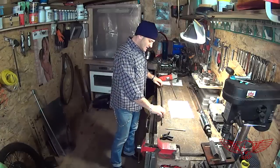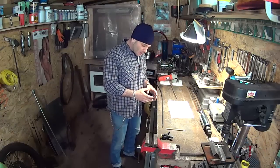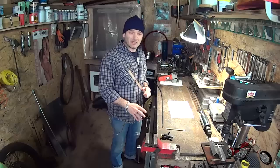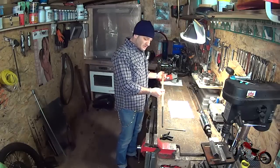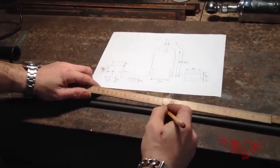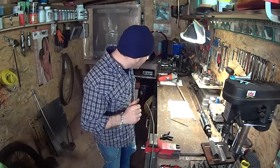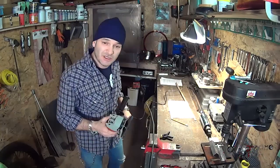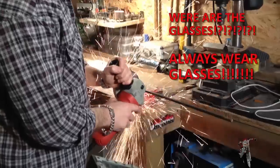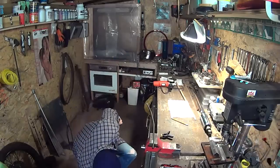To start, we're going to cut to size the pieces of metal that we'll use for the structure that holds the bolt, which will allow the threaded rod to go and compress the shock absorber. You can download the plans for this in the link in the description below. We need a piece that is 42 centimeters long, so we mark 42 centimeters, clamp it onto the vise on the bench, and proceed to cut with a little grinder I bought for just about 35 euros.